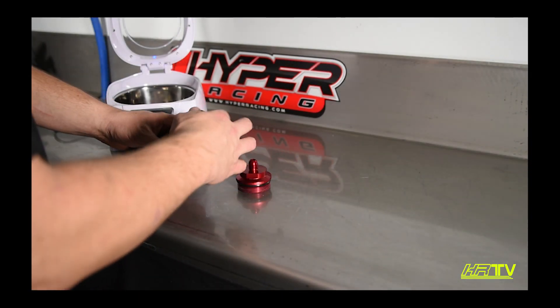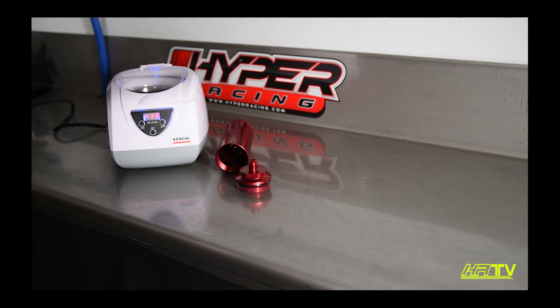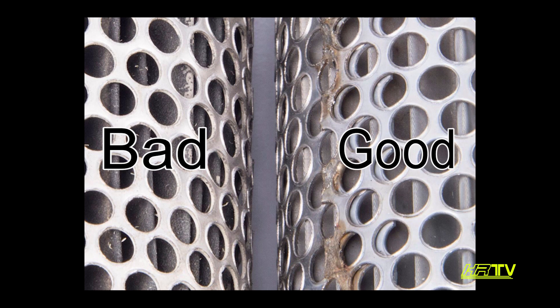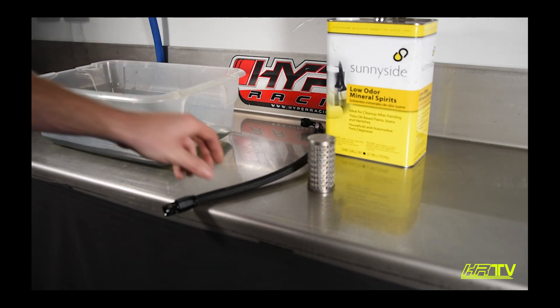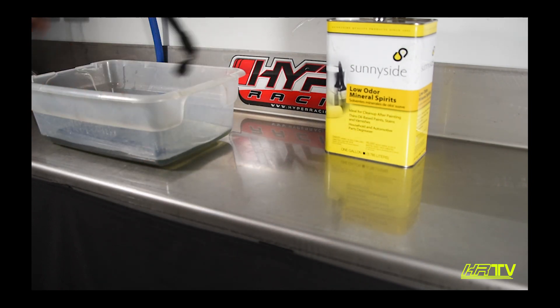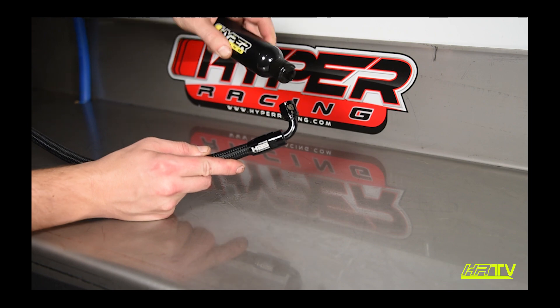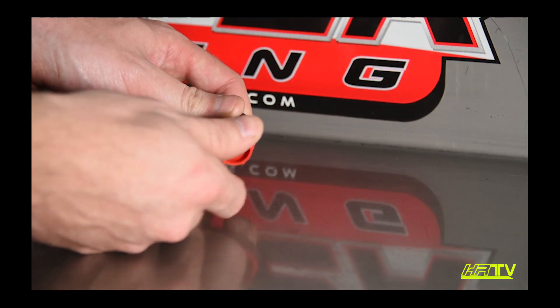Disassemble the fuel filters and clean the elements in an ultrasonic cleaner for about a 20 minute cycle. After cleaning, inspect the elements, especially the 25 micron element, to see if it's still coated in black gunk. If it is, it will need to be replaced — sometimes they just cannot be cleaned. Clean and soak the lines, filters, fuel rails, and shuttle valves in fresh, clean solvent such as a mild parts cleaner or mineral spirits. Force dry with compressed air and add a squirt of hyper fuel system lube into the fittings. Force the lube through the lines, then install caps and plugs to seal for the winter.